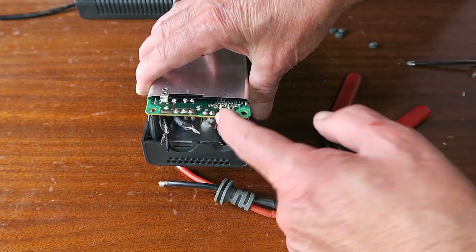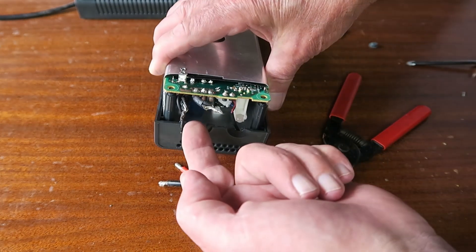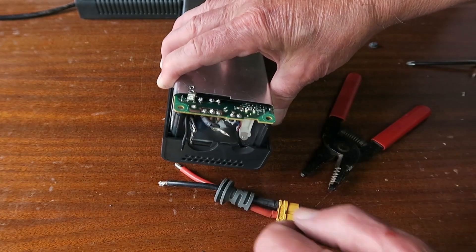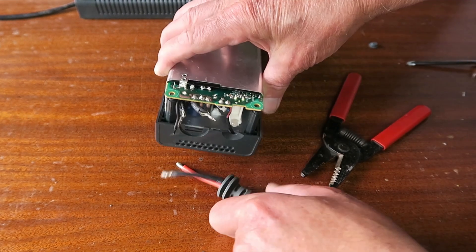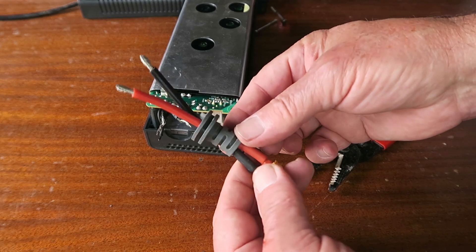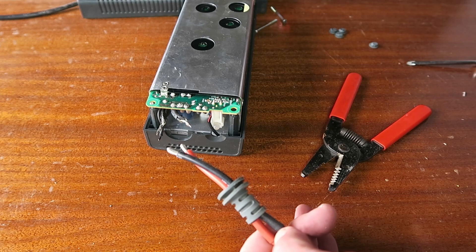I've cut the sense wires off and I'm just going to bridge across that solder joint. You could put a switch onto those wires if you wanted to switch the unit on and off, but I'm simply going to unplug it. There is a spare black wire — I'm not quite sure what it's supposed to do; it goes to a connection and shows continuity to the four blacks, so I'm just going to leave that one disconnected. Here's my prepared power connector for the charger — I've robbed the grommet from the original cable and passed the wires through it so it will fit fairly neatly in place.